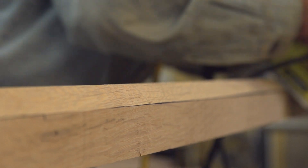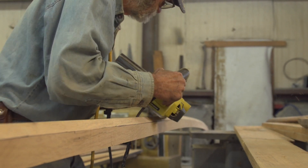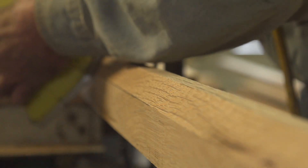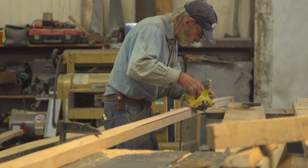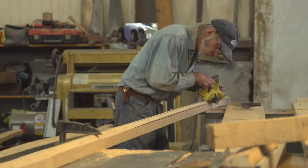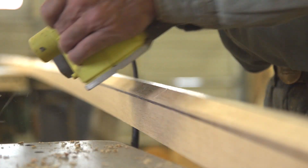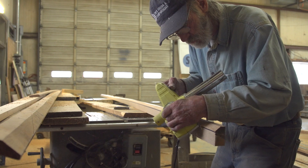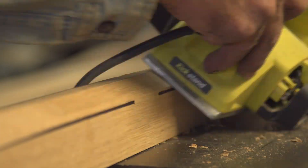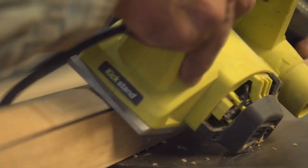I can't just make big long deep passes. This thing is adjusted really accurately so that the blades don't stick up hardly at all past the outfeed table. I could have used a router and just run right down there one end to the other with a 45 degree angle in one swipe, but I love using my planer so I decided to do it this way. The way I've got these lines set up, I have to look over the piece to see the line on the other side — that's a lot easier because I don't have to stoop. You might notice that I'm using a zip tie to hold the trigger down because the trigger's not in a position where I can use the plane like this and hold on to the trigger. Many tools over the years had a device to hold the trigger down, but this one doesn't — a zip tie does the job really nice.